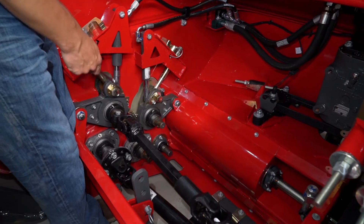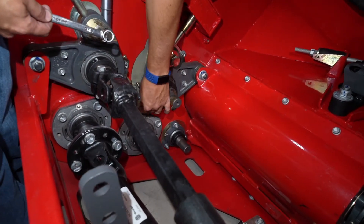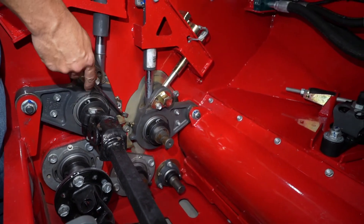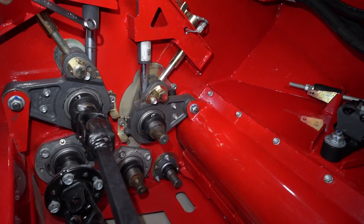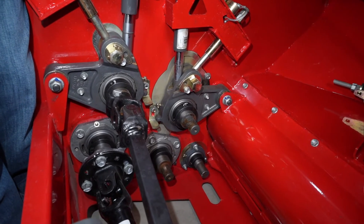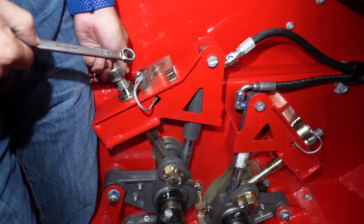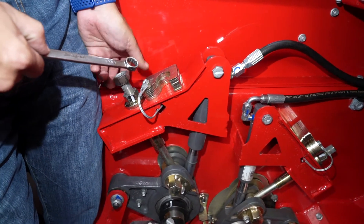To zero out your roll gap, you loosen these two — I've already loosened these with the wrench and they fall down. So those are your set brackets there. Now that you do that on both sides, you can actually move your retaining bolt here. We've got a set screw I'm going to take off — I've already done that. It makes it much faster if you use an impact. You can use a wrench if you want to, but it is so much faster with an impact.